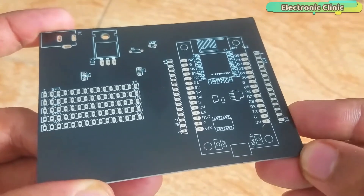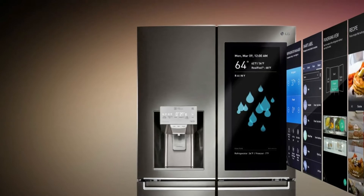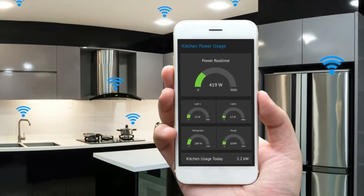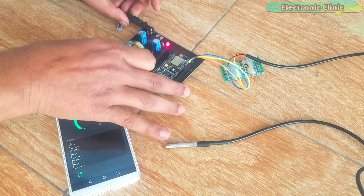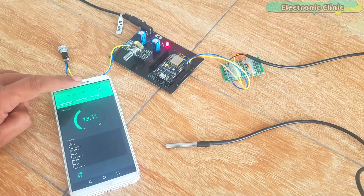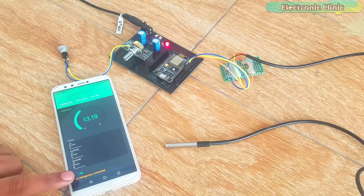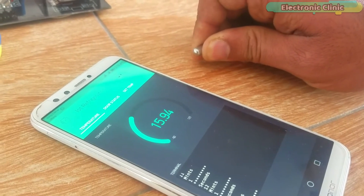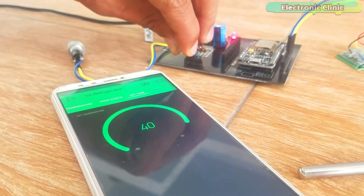You can find a link in the description. Internet of Things based smart IoT refrigerators are becoming very popular because with a smart IoT refrigerator, you can check the temperature, food items, expiry date, and door opening and closing status from anywhere in the world using Wi-Fi technology. In this episode, you will learn how to convert any fridge into a smart IoT refrigerator using a push button or limit switch, NodeMCU ESP8266 Wi-Fi module, a variable resistor, DS18B20 waterproof digital temperature sensor capable of measuring from minus 55°C to 125°C, and a cell phone application designed in Blynk. The values are updated every second.